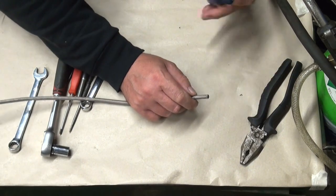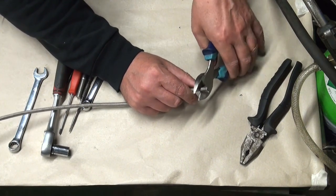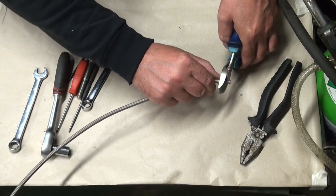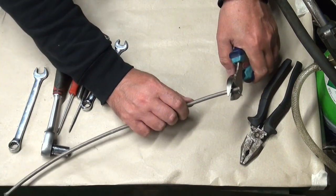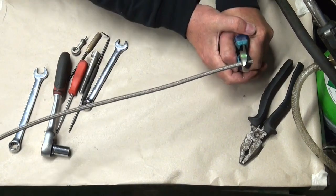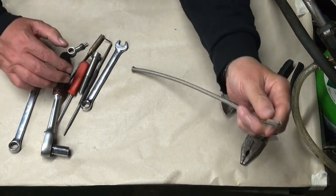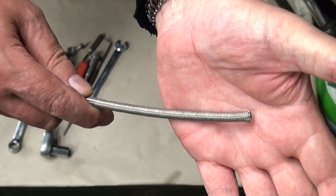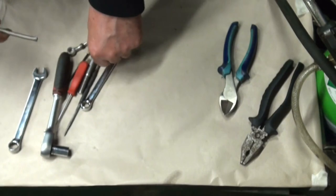When the olive goes on the end it has to sit flush on the inner teflon pipe. If I get right up close to the jaws I've got more leverage on that, so hold it square, squeeze squeeze squeeze squeeze - and pop it off. There you have it: a square cut, but we've crushed the inner.